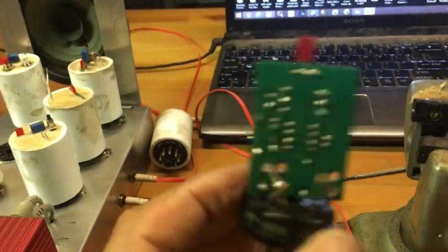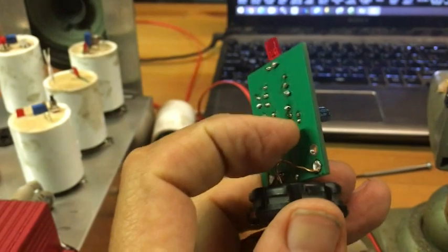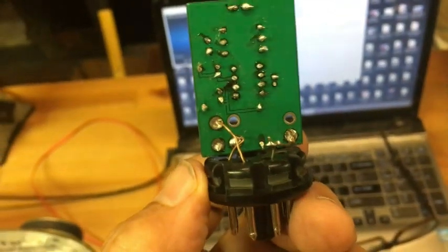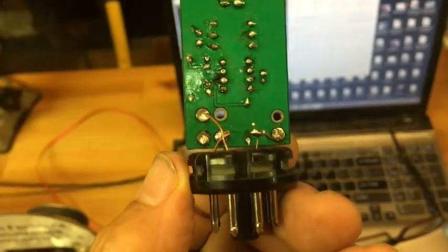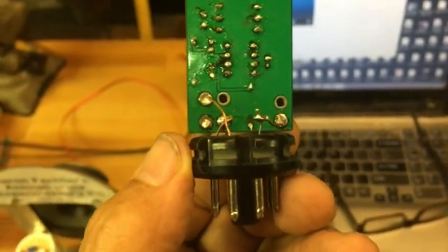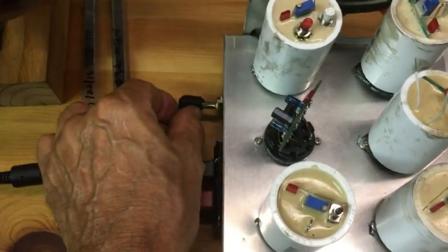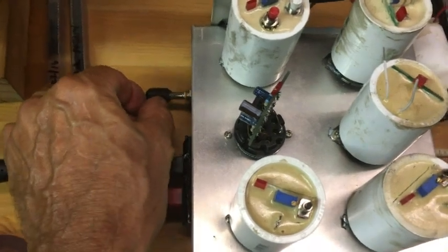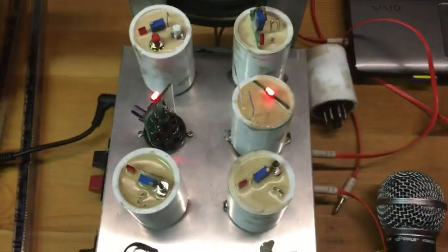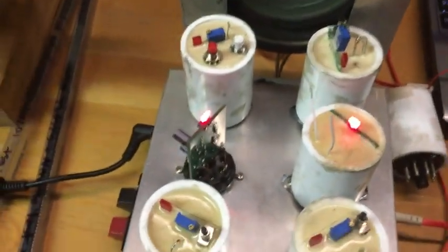Here's the next one - you can clearly see what it is. This wire isn't soldered into the pin. So there's the fix - I stuck another wire in there again, because the wire that's there just isn't going to be long enough to stick all the way through and have some clippable length at the end. Lights come on. Testing one, two - sounds good.